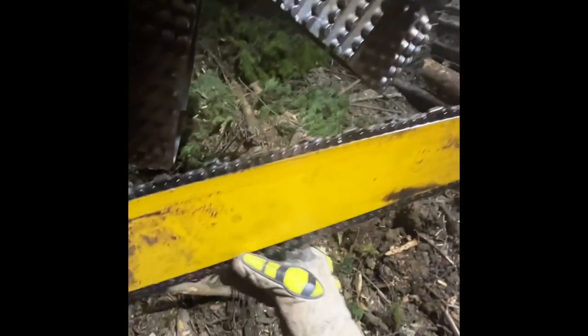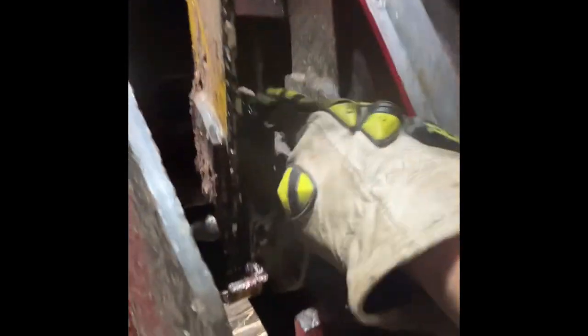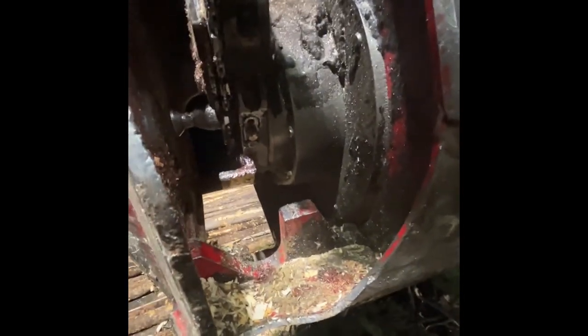When you're taking off the chain, you're going to pull down on here once you've hit the slider button. Push this up — right here. Hold that in, push this in — that's your slider. As you push it in, pull on this and it'll suck itself in. If it has a hard time going in the full way, chances are you have some sawdust and chain oil packed in there, so it might be time to pull it apart, clean it all out, and make sure it's all good.